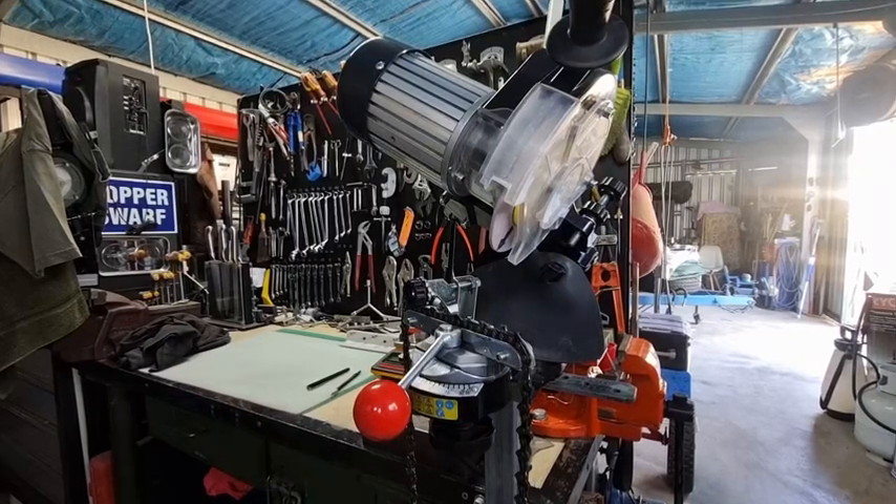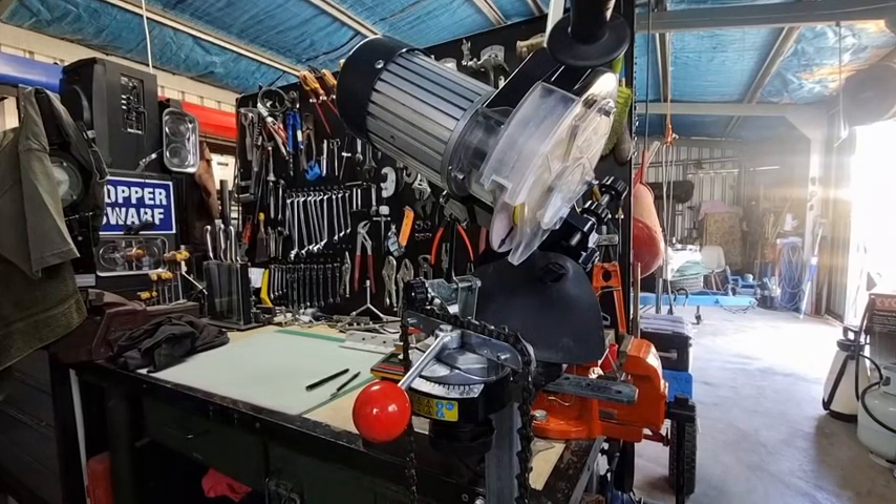Okay, so we ended up with 13 seconds on that one, and the previous was 11.9 — close enough to 12 seconds. So it roughly works out to about eight percent. The side plate, if it's blunt, is going to reduce cutting performance by about eight percent. I thought it was probably around five percent, because a lot of literature I've read suggests the side plate really doesn't contribute that much — it severs fibers, but it's the working corner, the first millimeter and a half on the top plate and the first millimeter and a half on the side plate, that does the work. The rest of the side plate down at the bottom of the gullet really doesn't do much, and that's what I wanted to demonstrate.